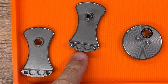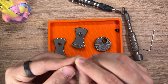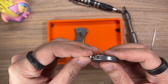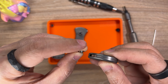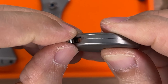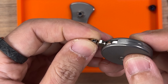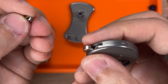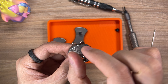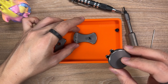Now we're going to reassemble the clamp area. The first order of things is to grab your pivot pin. Whichever half is fine because they are mirrors of each other — grab the pivot pin and slot it in. Then grab the alignment pins and insert them into the respective slots. Now you need to align the two magnets and make sure they sit in those two slots. If you just place the magnets there, they are going to snap to each other. So what you want to do is grab just one magnet, then use the main magnet on the disc to attract it and get the correct polarity — if it's the wrong polarity they will repel. Get the right polarity so it attracts, align it on one end of the cutout slot, then grab the other small magnet and do the same.